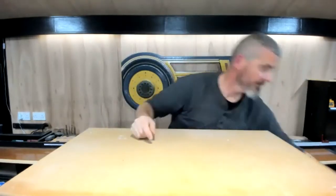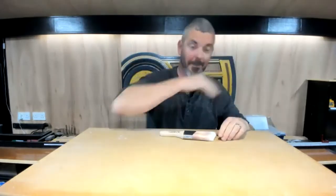So that's kind of about your wall prep. And you're caulking around your architraves and your skirting boards and everything like that, filling all your holes. And I suppose now it's about the paint and the paint application and how I would recommend you approach a wall. So if you imagine a wall as a rectangle, you go along the top with a small brush. You go along the top, you just create a band of white up into the ceiling, dabbing it whatever way you want to do it. You do the top first, then you do the sides, then you do across the floor. Then you do the top third of the wall, then the bottom third of the wall, and then you do the middle third last.